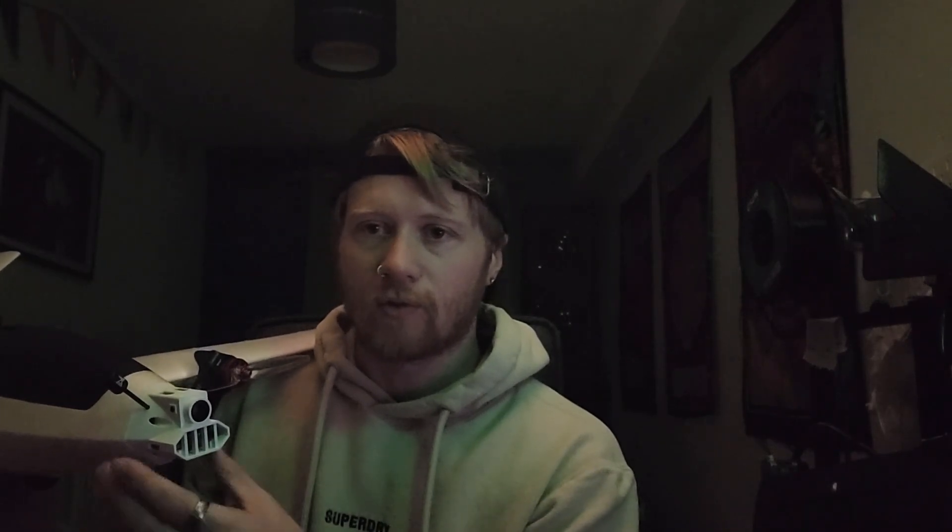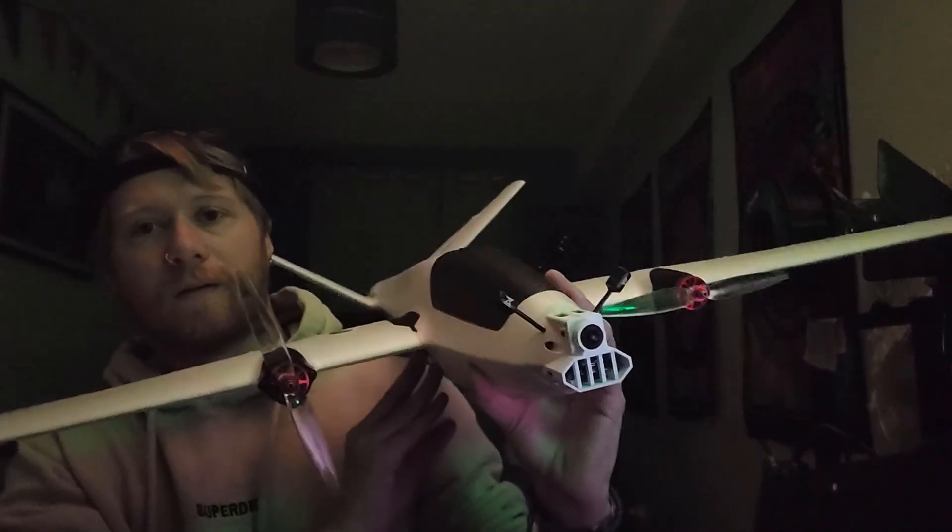This works really well and I've flown it a couple of times now. I was really nervous the first time I flew it that there wasn't going to be enough cooling and the video transmitter was going to overheat. When you're waiting on the ground for a GPS lock, the transmitter will start to overheat and you'll get a warning in the goggles. But as soon as you throw it in the air, within about two or three seconds that warning disappears because it's getting so much airflow in there, cooling it straight away.